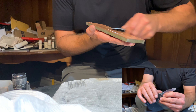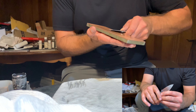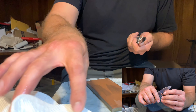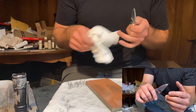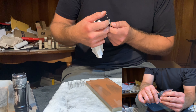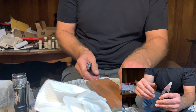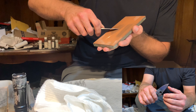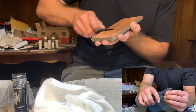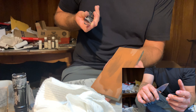It's important moving through the sharpening, especially at this end stage, to look for spots where the polish hasn't come up — anything cloudy or hazy. You don't want to put that into the strops. The strops can take out some of it, but what you can remove with the stone, it's good to get it done. It's also worth noting that diamond waterstones' ability to cut, even using stones as fine as the 3 to 2 micron from Venev, means you can take out cloudy spots more easily than you would with, say, an aluminum stone.